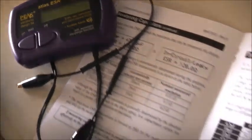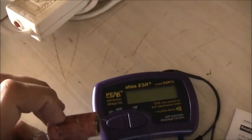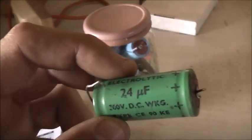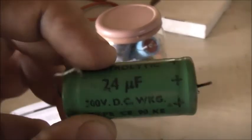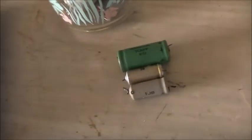Another thing I found out — there was a bit of a misspelling, 'Osteralia', but it didn't have any problems getting to me on time, just in time for Christmas. This is the only bad cap I've found. It charged up alright and I thought it was good, but the meter disagrees — it says it's open circuit or leaky. These three here were way off on microfarads: one measured about 30 microfarads even though it was rated 24, another was about 57 even though it was a 25, and the last was about the same for a 25 microfarad cap. So they'll need reforming.